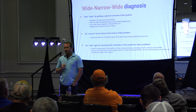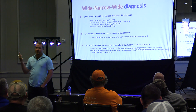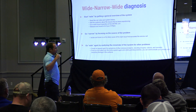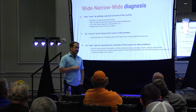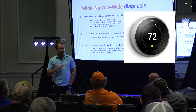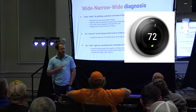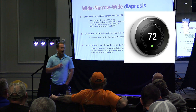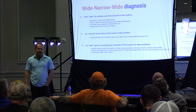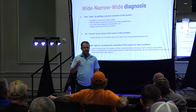Then you go in and talk to the customer. Maybe it is that failed run cap, maybe it's a backed-up drain. We probably have a ton of backed-up drains when it's humid. You go in, you look at the thermostat. Hey, they've got a new Nest thermostat on the wall. When did you get the new thermostat? 'Oh, my husband put that in three weeks ago. He blew the fuse but figured it out and put a new one in.' We're going to check that fuse — you're paying attention to all those things.